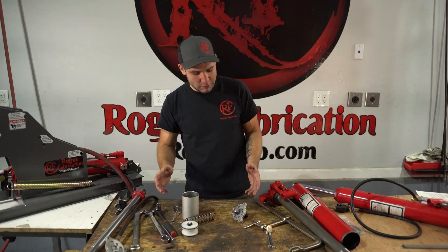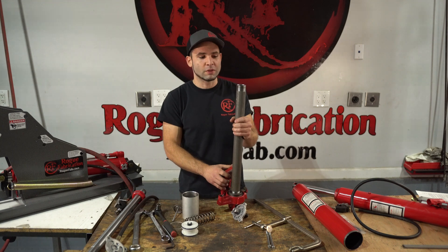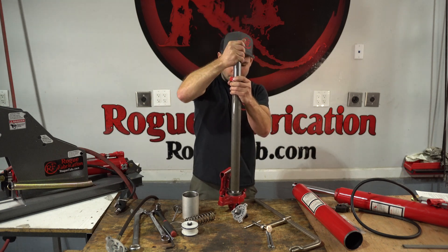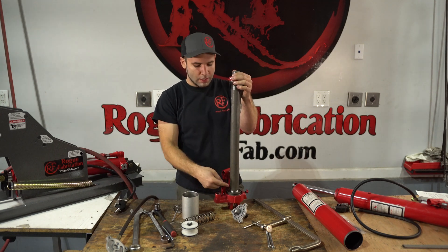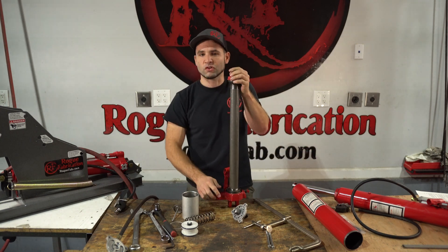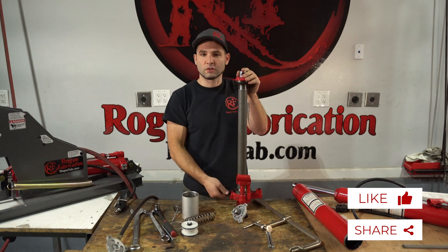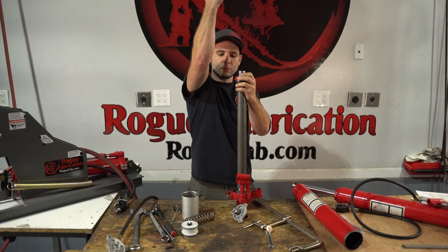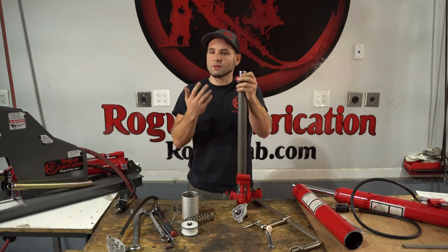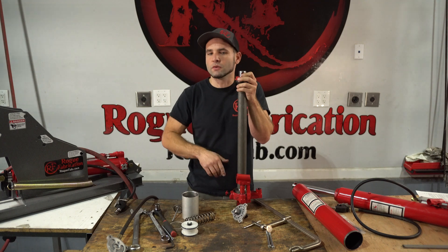If one of these pumps picks up air, it will push air up into the hydraulic part of the cylinder — this is the cause of most people's problems. They end up with air inside the cylinder where there should only be oil. When it's down, there should only be oil between the pump and the inside of this rod. If you ever run it sideways or in the wrong orientation, or too low on oil, it'll start scavenging air and push those bubbles into the cylinder. The nice thing is there's almost no room when it's fully closed, so bleeding is very simple. Stand it up vertically, open the hydraulic valve all the way, and push down the rod end. You'll hear some bubbles go through the pump and valve, then keep it vertical and run it again. It'll pick up just oil and pump just oil in — do that a couple times until you hear no more air and bubbles.